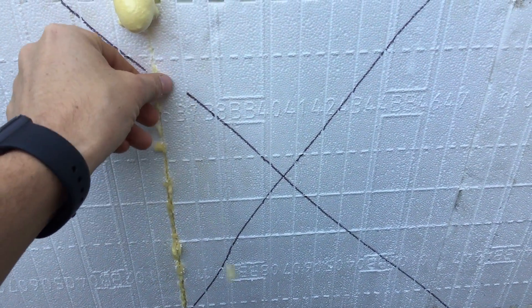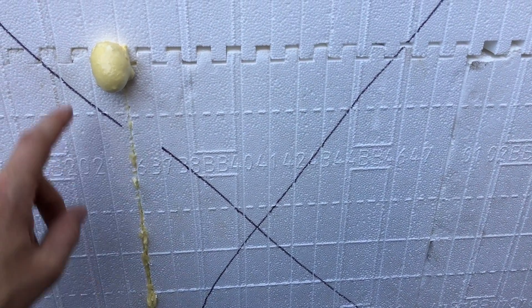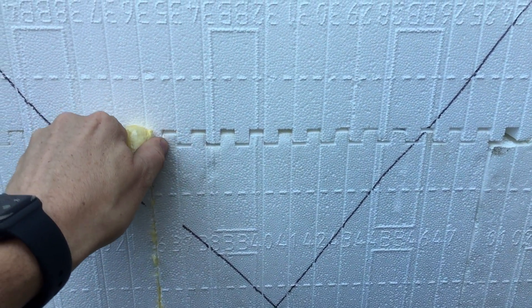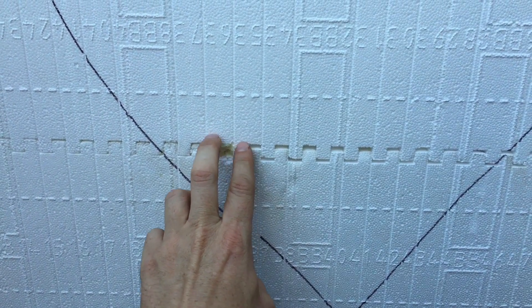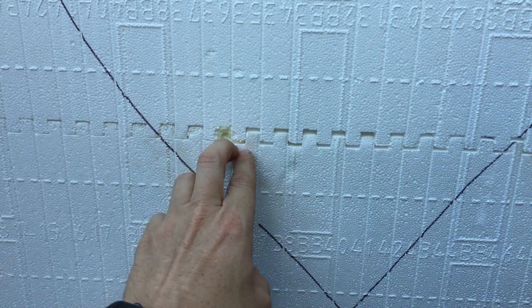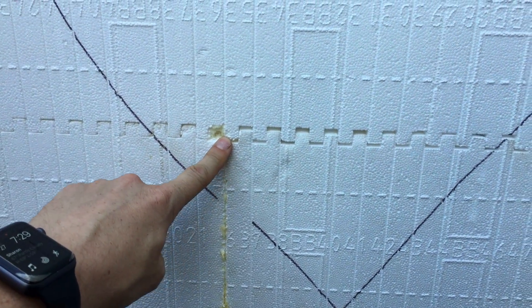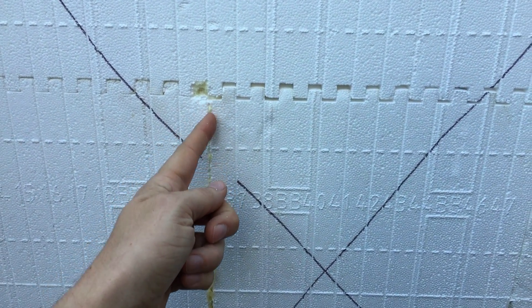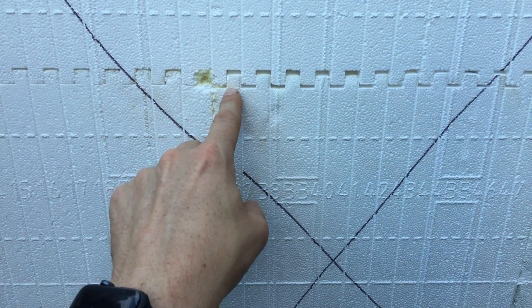This block here — we originally put it in and it was a little tight, so I decided to jam it in and got it to fit. That was fine until I went to put the block on top of it. Because I jammed it in, it spread the block and changed where the teeth fell — I found I could not get the top block on at all because I basically had half a tooth and the block just wasn't going to happen. So I ran the saw down the line, cleaned out the styrofoam, did that a couple more times until the block came in and I was able to put the next block on top.